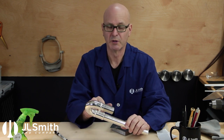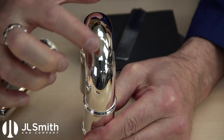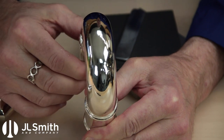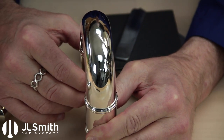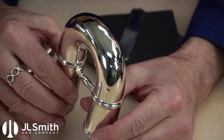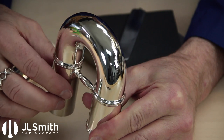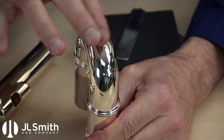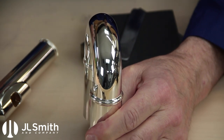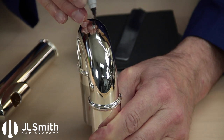In this case it's a silver-plated part, but it could be a lacquered part or something like that — we'll replate this as the final step in the process. Here are those cottage cheese areas I was describing earlier. That's where the dent was lifted out with dent balls, and dent balls often leave that type of appearance. We want to match the mirror-type finish on the sides on this crest here. While I'm examining the area, I'm looking for any low spots and marking them with a Sharpie.